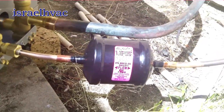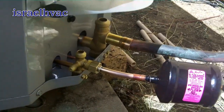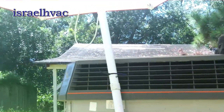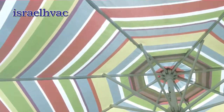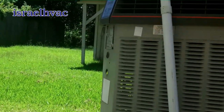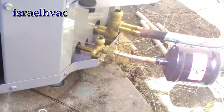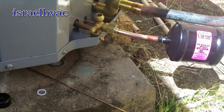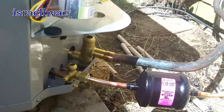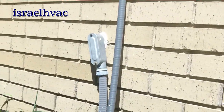Alright guys, I got the new unit in place and fitted up. Got my dryer in there, suction line — just made a bend with the Hilmor. The old Trane is now holding up my umbrella keeping the sun off me, so that's the new job for the Trane XL1200. The air handler's in place. I'm going to go ahead and braze this up as soon as we get the nitrogen flowing.